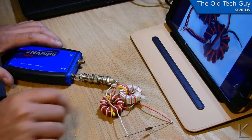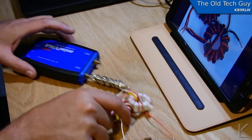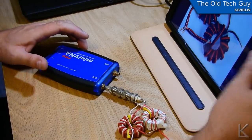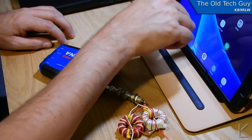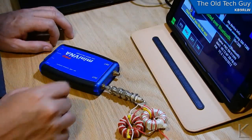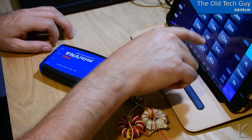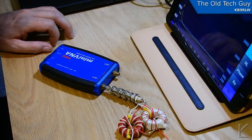All right, we got it all finished. I've got it wired up here temporarily. Got this 200-ohm resistor tacked in on the output. I've got the mini VNA hooked up to it, and I'm getting ready to load up the mini VNA software. We will sweep the entire HF spectrum. Let this get connected — connected. Okay, that's not bad.